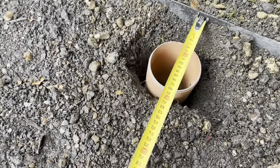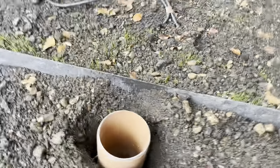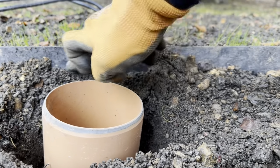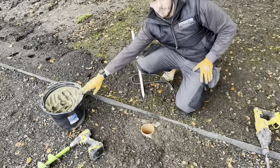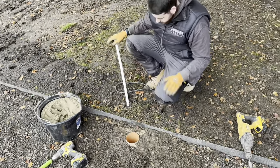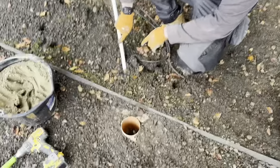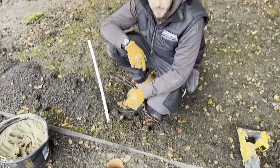The hole's drilled out for the light — we've got about 12 and a half to the center, which is pretty good. We want to make sure it's about halfway. We've got the waste pipe into the ground, made a bit of mortar up to hold it in place nice and sturdy, we've got our trunking legs for the Wiska boxes, and we've put our conduit in for the cable access for the lights. That's the main setup for the lights going in.